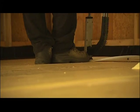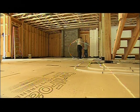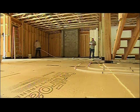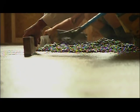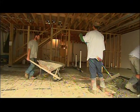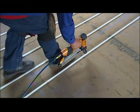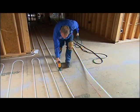There are 11 loops spread out through the basement, designating certain areas. For example, the bathroom itself is on its own circuit, so if you want it warmer than the rest of the basement you can — when you're down there without your shoes on, you can walk in barefooted and the floor is actually comfortable. Once all the tubing was run, a concrete slab was poured over the top to fully embed it. The concrete not only protects the pipe but also provides a thermal mass that warms up as heat runs through it and helps maintain an even temperature across the floor. Later Jason came back and took care of the first and second floors, and the loops are set closer together near windows and exterior doors to get those spots warmer on a cold winter's day.